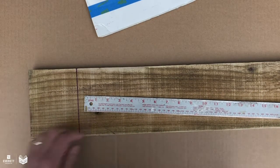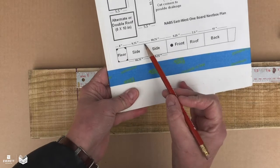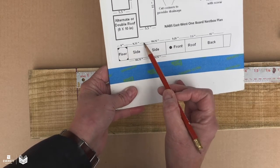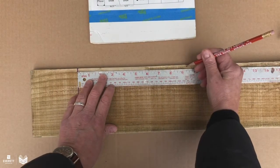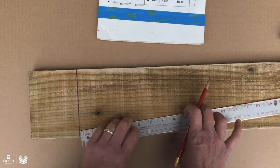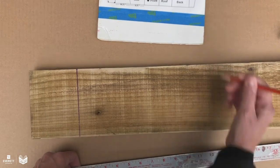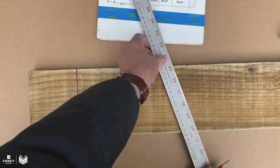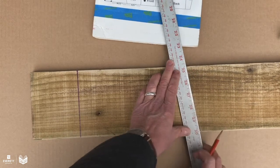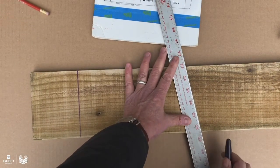Right away we're going to encounter this slightly unusual situation with these angles. Using this diagram, from the four-inch point to the next point is 9.25 — nine and a quarter inches — so we'll make a mark there. But at the bottom it's 10 and a quarter inches, because we want to create our angle. Make the bottom mark at 10 and a quarter, draw your line across there, and now you've created the side so you'll have a slanting roof.